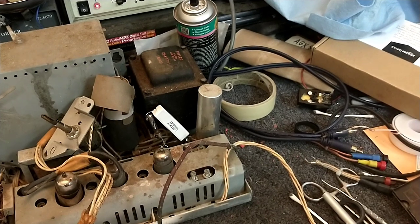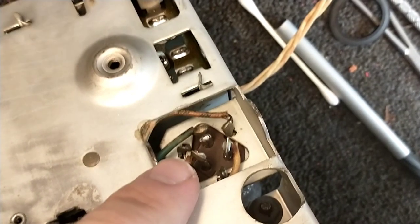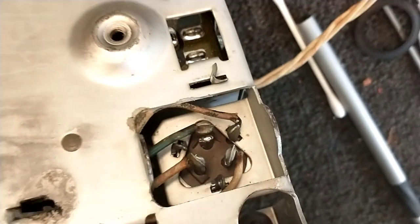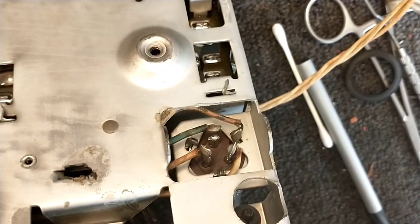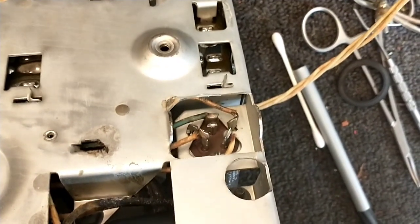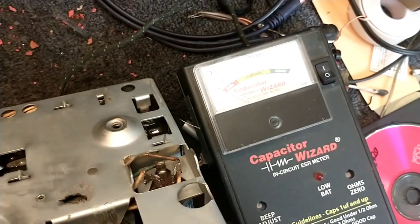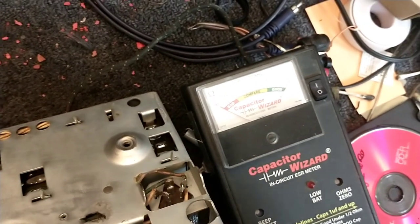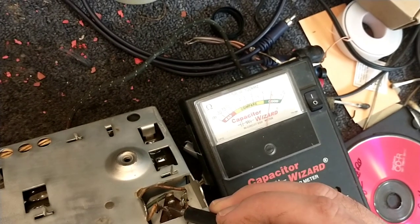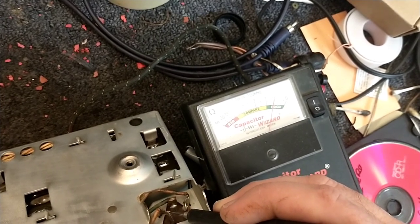Let's flip it up and see what we're getting. This lead on the left — this is our 10-microfarad. We just have to disconnect this line and figure out if the capacitor is at fault. I'm pretty certain it is. Now here's where using an ESR meter to troubleshoot this is wrong — because if we go to the 10-microfarad, we see it has a very low ESR. It looks good, 10 microfarads. Woohoo, that's a good capacitor, right? Not necessarily.